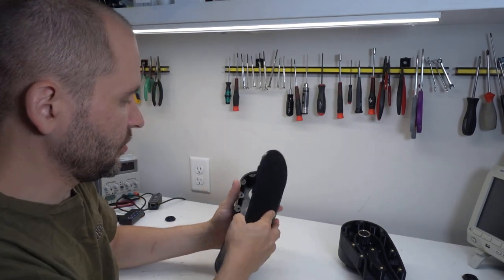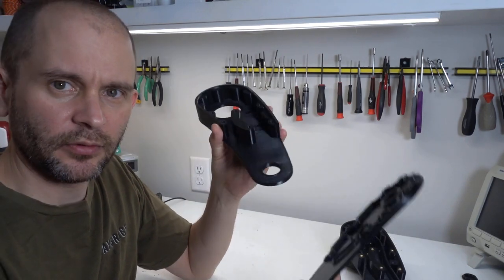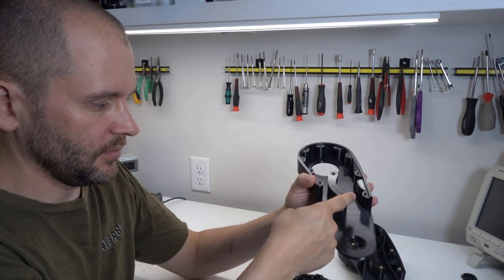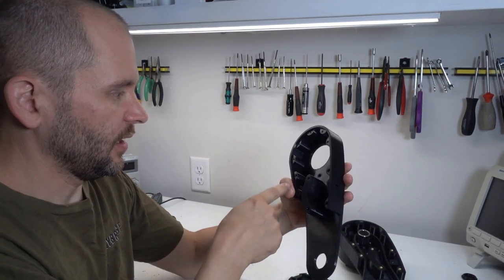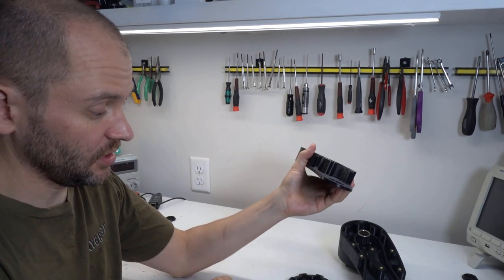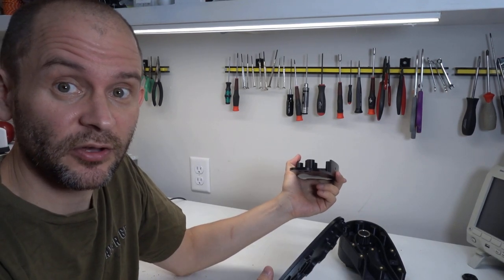So a trip to the 3D printer has resulted in a new upper leg, lower and base section, which is both slightly longer, has the tensioning carriage further in towards the belt, and has appropriately sized screws for all the hardware. But we have to first clear out the support and reinstall the heat set inserts, so we'll get started.